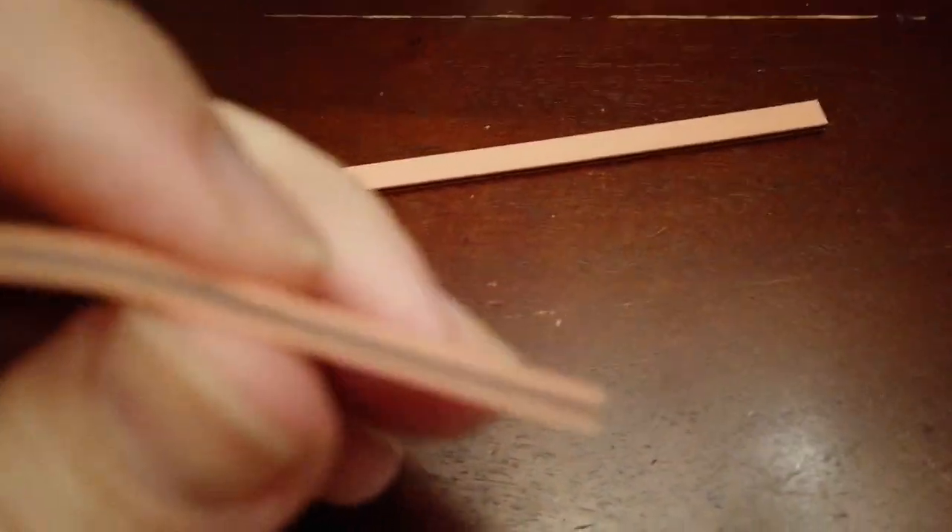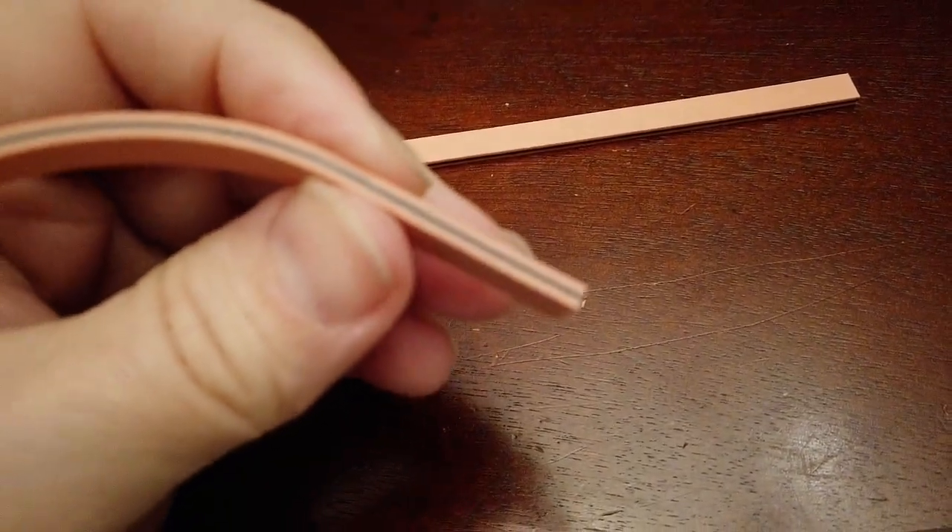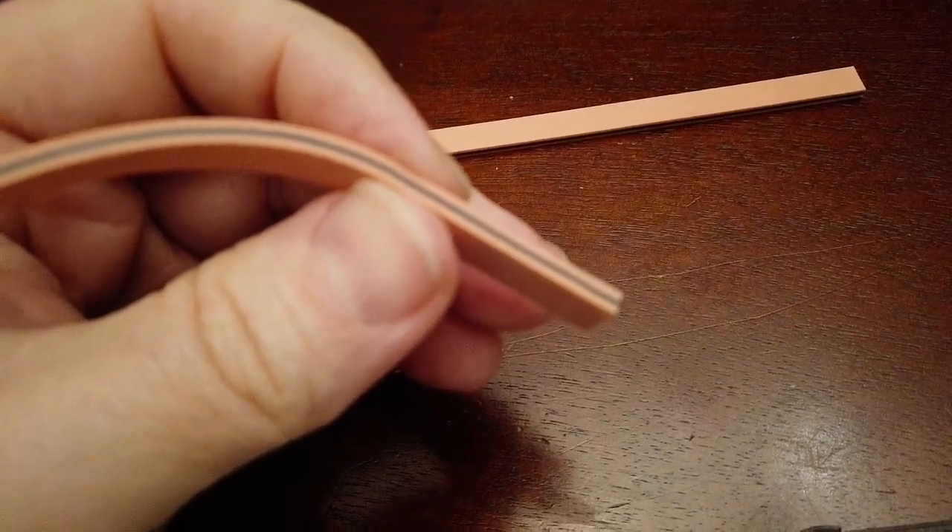I've got the zebra strip out on top. I'll clean the LCD itself, then clean both sides of the strip and get it back in, and hope I have everything lined up correctly. I think I've got everything cleaned out. These zebra strips have an alternating conductor-insulator-conductor-insulator pattern going on, which matches up with the connectors on the LCD itself. I didn't really see any particular visible dirt or corrosion on anything, but who knows.